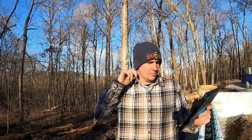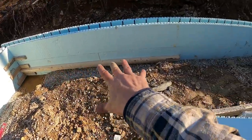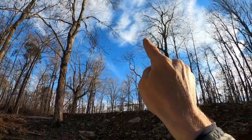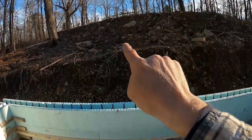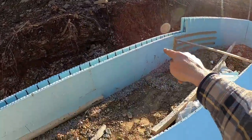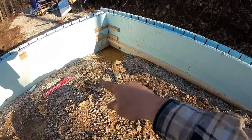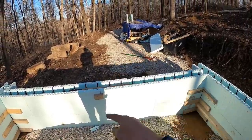Thanks, I appreciate that. And in regards to the whole indoor plumbing thing, all the plumbing will be right here. The half bath for the master bedroom up in the wheelhouse. I don't know if it's gonna be that high, but somewhere up in here, there's gonna be a toilet and, well, a sink, I guess, would make it a half bath. And then there's gonna be a pipe that comes down out that back wall. Kitchen sink right in here. Same thing. It's all gonna run pretty much down there. And then, like I said, full bath right here. So all the plumbing is stacked right here in this corner, which is why I didn't put anything there. And then it'll go out that wall. The septic tank will go pretty close to where that propane tank's sitting right there.